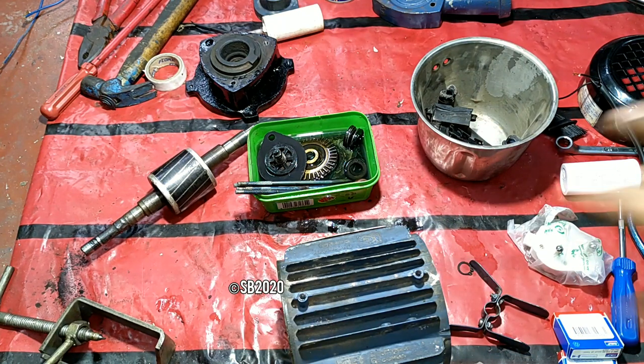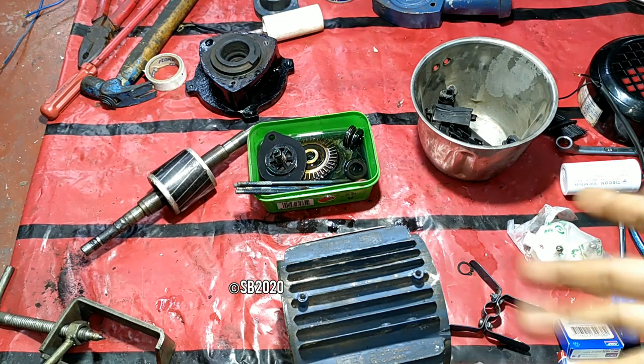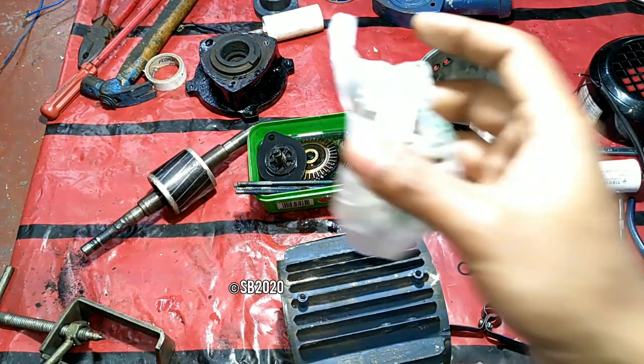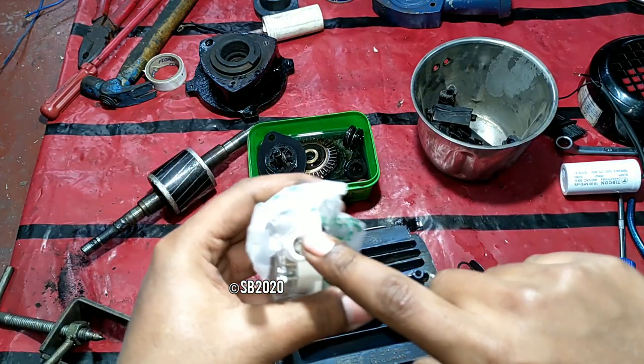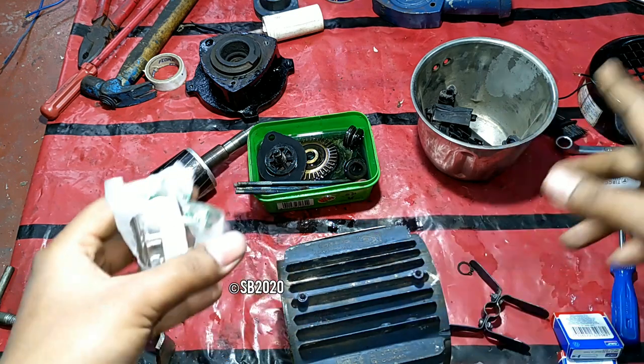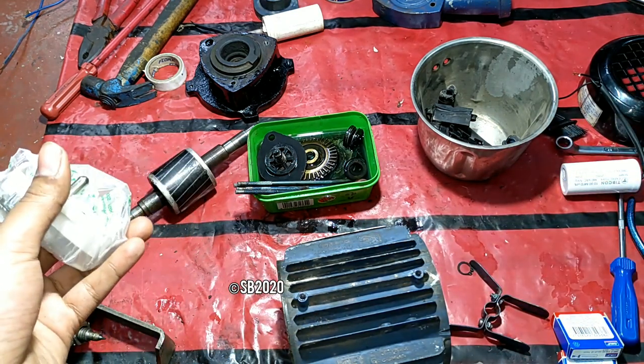And if you don't have any means, if you have only one color of wire, do it, no worries, because this kind of pumps or motors don't need color coding, because the plug is a stationary part. You will not interchange it. Only during connections you must note which is the earthing, which is the phase, and which is going to neutral. After connecting everything properly, then it's okay. You don't need any kind of color coding harness here.